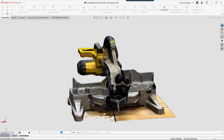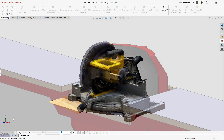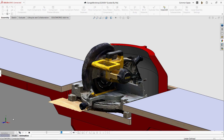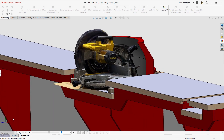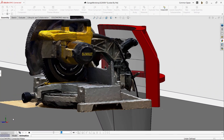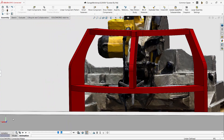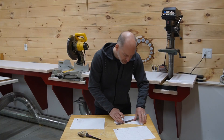The level of detail scanned is amazing, allowing us to design a dust shroud that perfectly fit around the saw. With the 3D scans, I can confidently design a dust shroud that wouldn't interfere with the miter saw's range of motion. I want to experiment with a fabric shroud, so I'm starting by designing a frame to hold it. I quickly model this basic structure, and then print out a drawing that I can use to make paper templates.